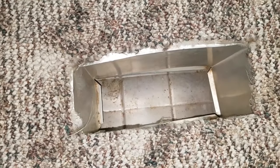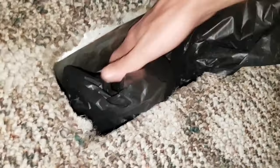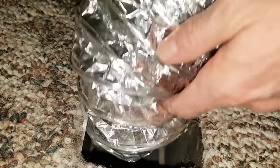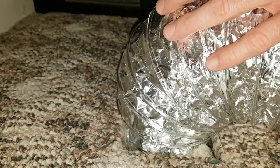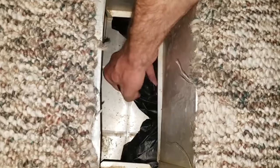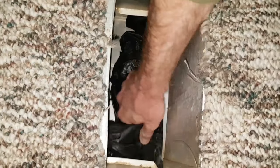This vent opening is near the center of a particularly long segment of duct work. Using a new trash bag stuffed with a couple other bags, I plugged off one segment of the duct so that the two halves could be done separately. In goes the foil hose and the unplugged segment is cleaned with the whip. After vacuuming out the debris left conveniently at the vent opening, I moved the plug to the other side, thus blocking off the clean segment. This prevents debris from being accidentally swept into the clean side while sweeping the other half.